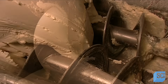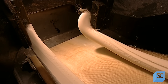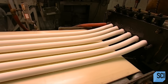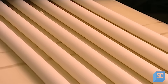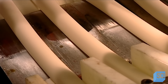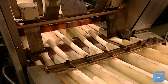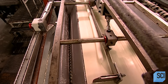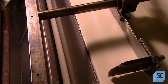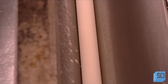Workers dump the batch into an extruder that shapes two continuous streams of batter called rope. Another extruder divides each rope into six hollow tubes. The cavity inside will become pockets of air inside the gum centers. The next machine slices the tubes into segments that are three feet, three inches long. A mechanical arm pushes the segments into the channel of a forming machine, where steel rolls slice through the tubes and shape them into balls.